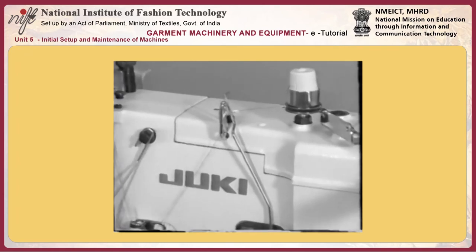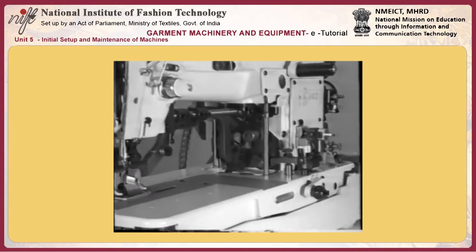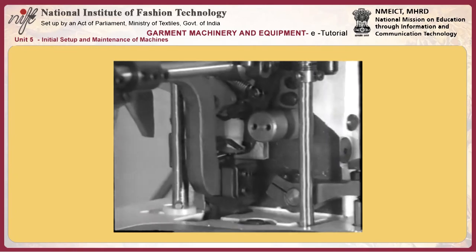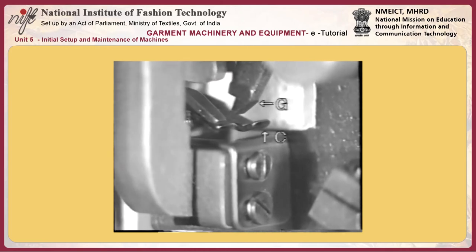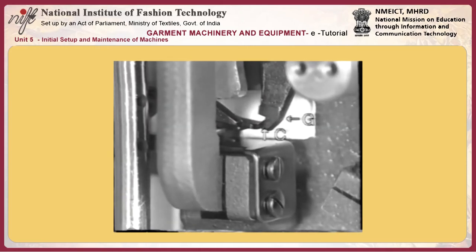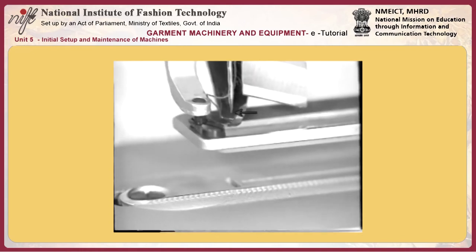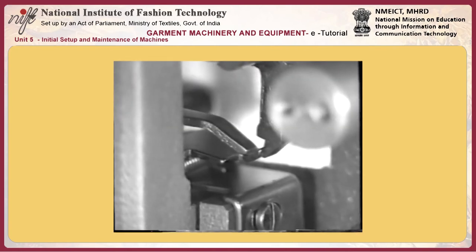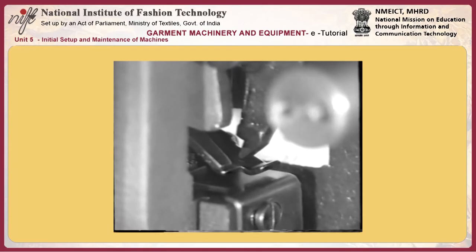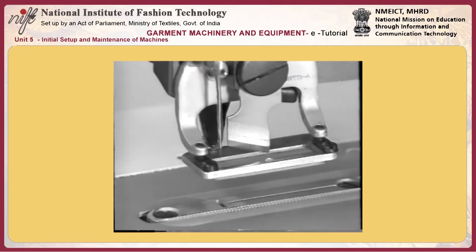When top end G of the latch presser arm comes off locking bracket latch C, the needle thread trimmer moves to the left. When pin S of the needle thread trimmer comes in contact with driving bracket B, the needle thread trimmer opens to release the needle thread. Loosen screw A and properly adjust timing to open the needle thread trimmer by shifting locking bracket latch C back and forth. Move the locking bracket latch toward you to shorten the time during which the needle thread trimmer retains the needle thread. Move the latch away from you to lengthen it.